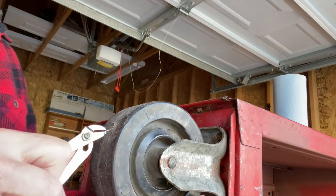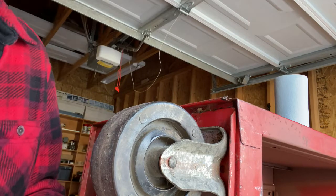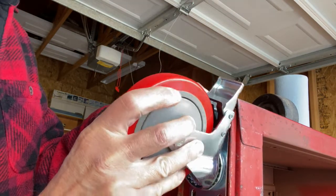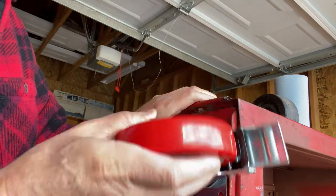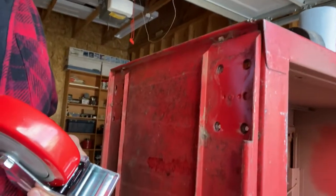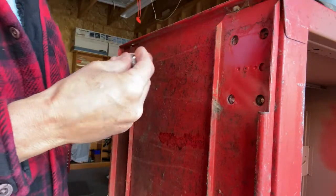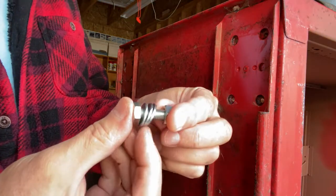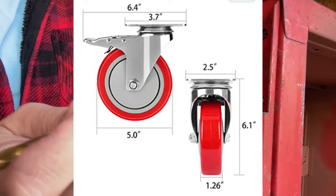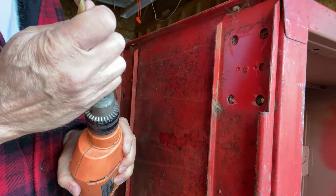The actual conversion process is pretty simple. Here I'm pulling out some metal shards that were stuck in some of the wheels so I don't stab myself with them later. All you need for the Craftsman tool chest is a flathead screwdriver to pull out the four screws that attach it to the bottom of the chest. Here I'm test fitting the new caster to make sure the hole pattern aligns — and they do — but the new caster bumps into the lip on the bottom of the tool chest. To take care of that I'm going to put in some washers between the mounting plate of the caster and the bottom of the chest. Even though the hole pattern aligns, the hole sizes are not the same, so I'm going to have to enlarge the holes in the cabinet to 3/8 inch using my Harbor Freight half-inch hammer drill.